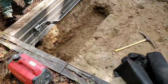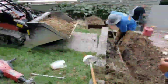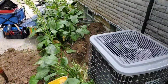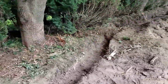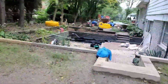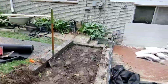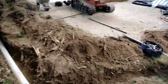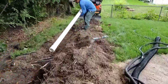So here's our pit. We dug our pit and we sized it. We're going to put in a full frame 25-inch Screaming Demon outdoor sump pump system with some added chamber length. We have the sump pump from the basement running to it. All right, so these pit patios, these forced walkouts, you always have to put a pump in them. There's our Screaming Demon outdoor sump pump. Here's our discharge line. The guys are tying everything in.